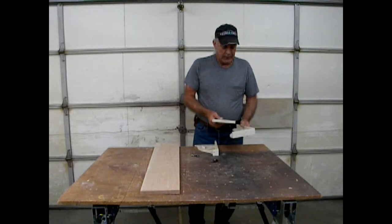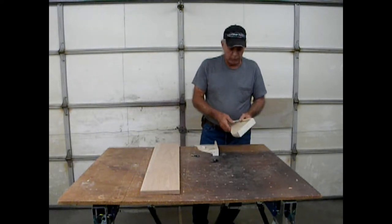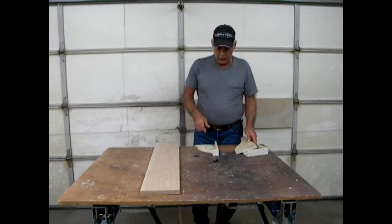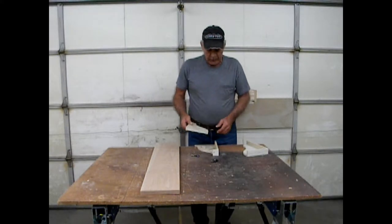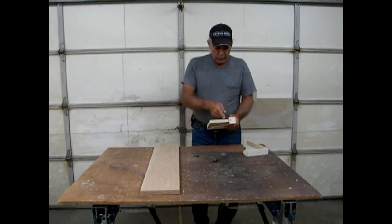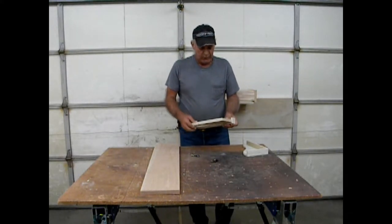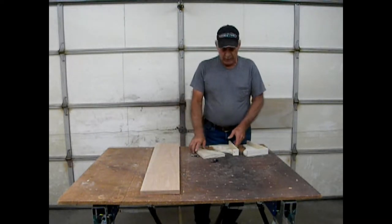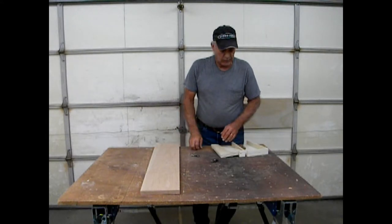Stay close to the line so you don't have a lot of material to remove and you'll be happy with the results. I actually have two sleds here. One cuts the corbel profile and we'll cut four of those pieces. Then we need to cut the profile for the interior spacers that create room to insert the gun into the cavity. A second sled trims that down to give me a little ribbon of material that I can glue up to create the interior cavity.